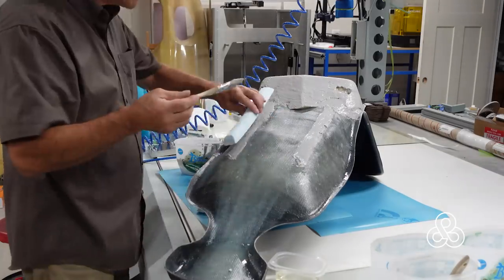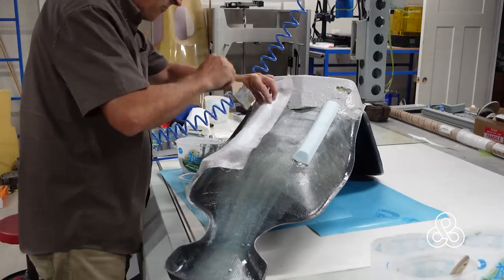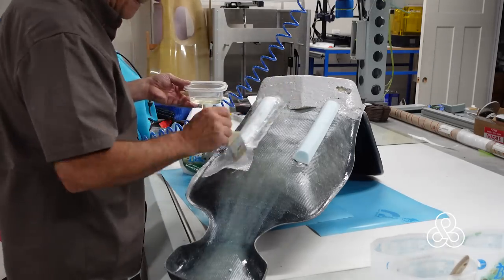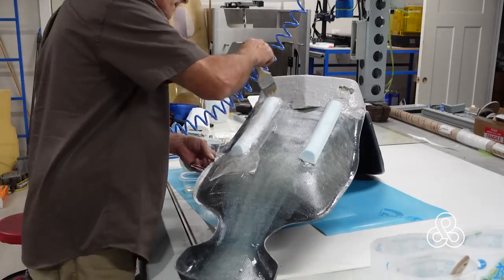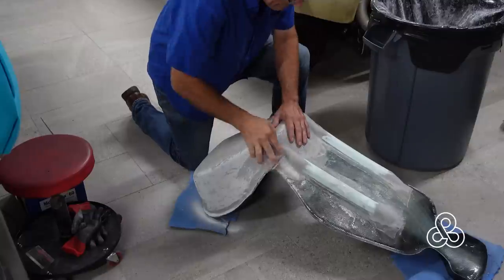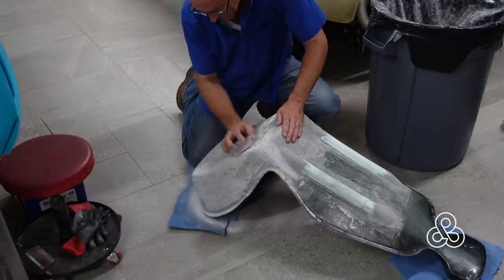The back of the chair sits up against the bulkhead — not tightly, it's only going to be fastened to the floor — but we want the chair to flex a little bit, just not so much that it's bouncing back and forth. So we're putting these runners on to stiffen the back of the chair. Once they're cured with the fiberglass cloth holding them in place, we'll go back and sand the whole assembly — the slurry and the fiberglass cloth on those runners. I also took some slurry putty and faired out those runners to make a nice smooth transition as the cloth goes over them. Get this all sanded up, at least the high spots knocked down.